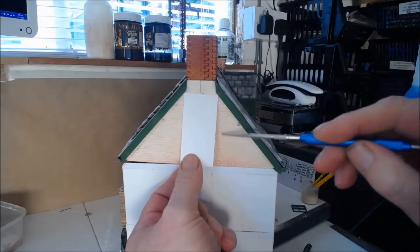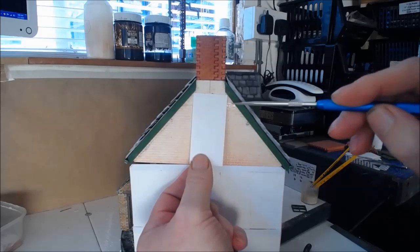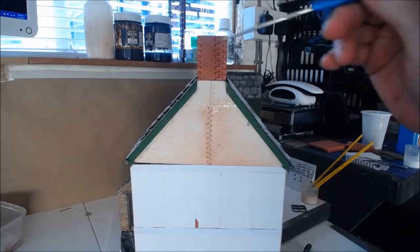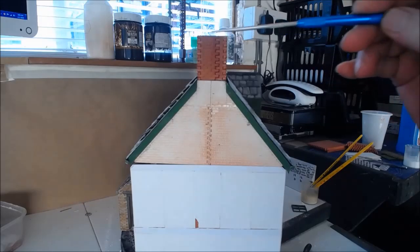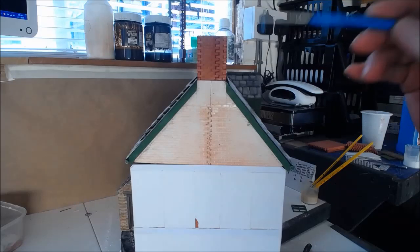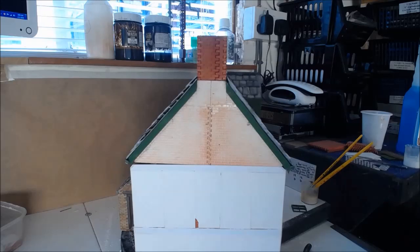So we're going to fit all these ends in with plaster sheet. We're going to plaster sheet the actual chimneys all the way around, and then on the top I've got some corbel courses and chimney pots, which we're going to put on as well before we move on to actually lining this out with the brick, well, the block should I say.